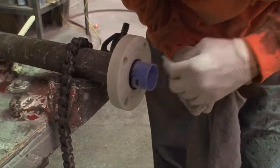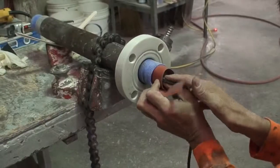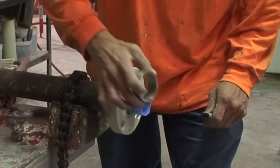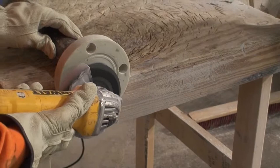Clean off the excess glue from the MaxR and allow the flanged epoxy to become tacky. Next, install the internal heating collar for post-curing. Using the proper trim collar, mark a line on the end of the MaxR tube and grind back to this line.